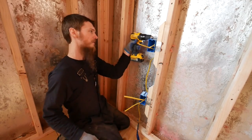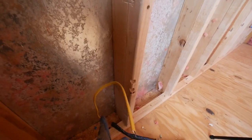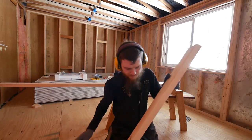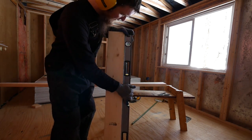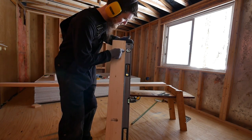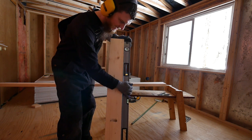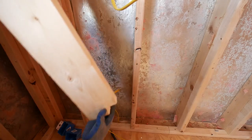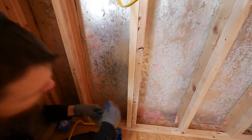It's better to fix it now than to leave it and regret it. There it is — all clean, removed any staples, anything that was in here. Now let's get a piece of wood cut. This board has a little bit of a crown to it, so I'm going to trim off a little piece to straighten it out so it's not pushing out the wall. This is a spare two by six I didn't use on the ceiling. I notched out the bottom to fit around my spacer.